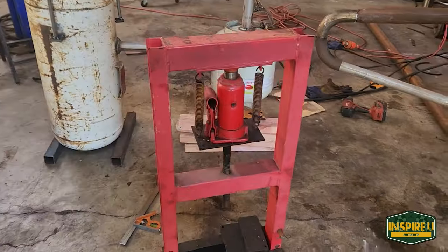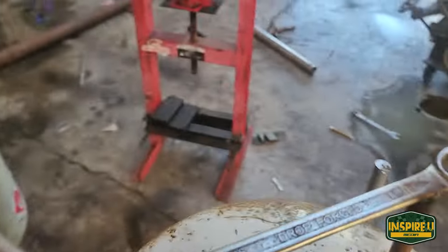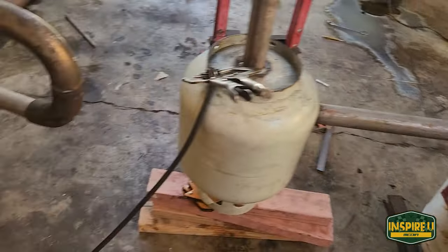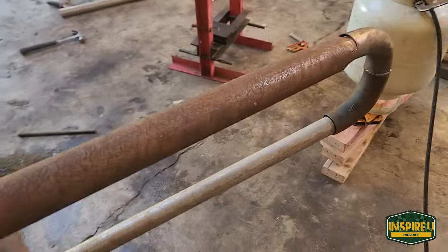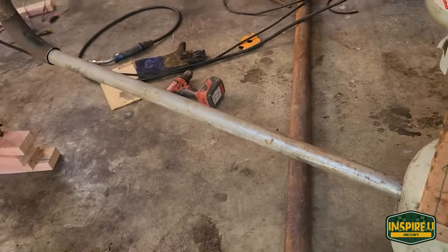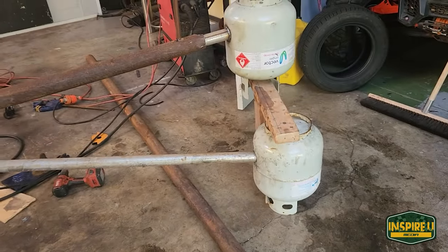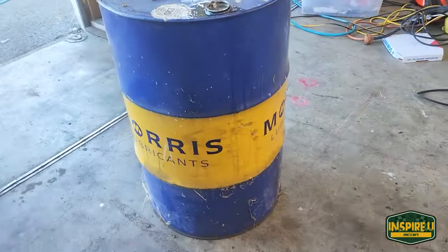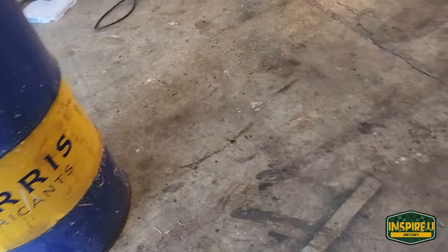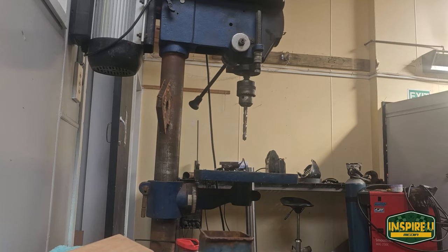This is how far I've got — started putting these on so I can seal the lid. One of those is fully welded, this one's just tacked. Got to finish welding that one up, make another one on the bottom, connect all the water tubes, and get a fitting on the top. We'll make a little frame to hold it upright, and we also need another 40-gallon drum to extend the top and fully cover it with a chimney to enclose the entire thing inside the fire source.